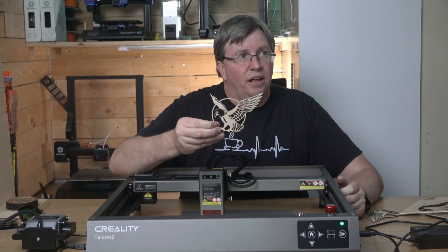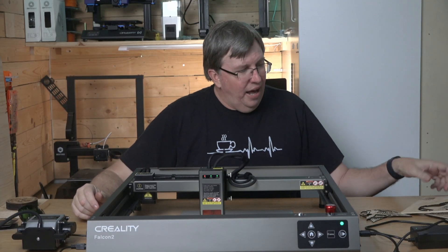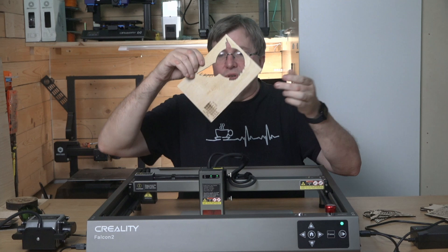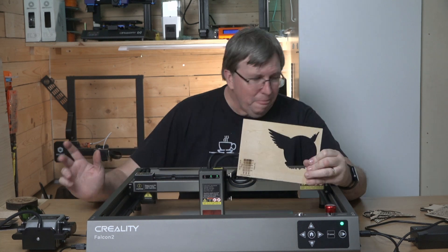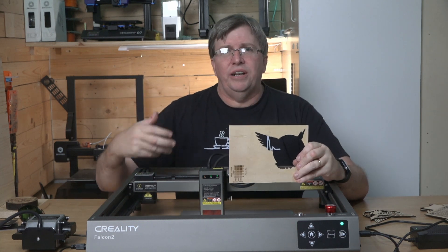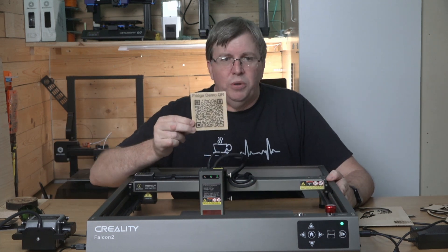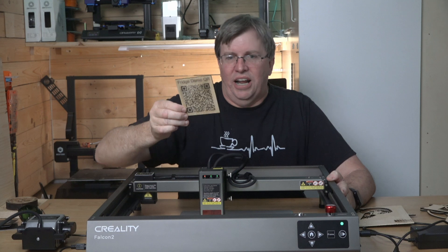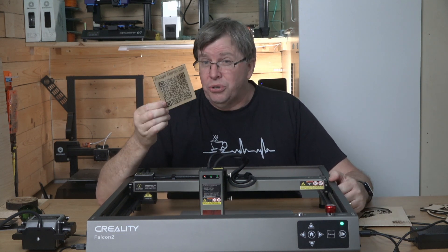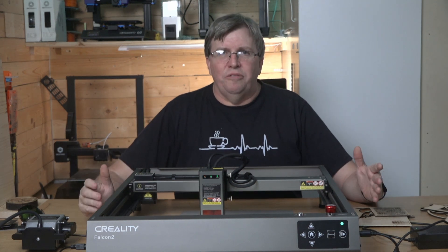The eagle cut in three millimeters - there is literally no difference in quality. The cut is perfection, it cut easily without batting an eyelid. The biggest tip I can give with this machine is to print out your test zones and play with them, as it gives you a good indication of what the material can handle. I then played around with QR codes - a little demo for a work project - and it works perfectly, scans easily. I want to try this on stainless steel.